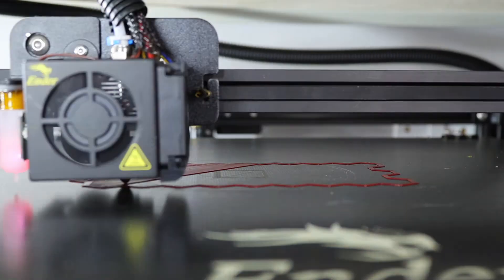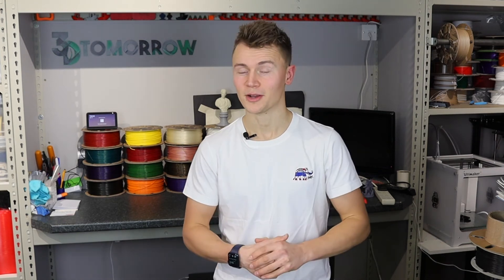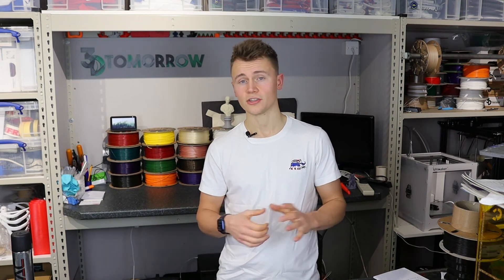So that's the first six steps. At that point you should at minimum have the first few layers going down perfectly with no signs of warping or separation from the build surface. If you haven't, go over them again — I'm pretty confident you will have overlooked something. However, it's still possible to see some separation happening later in the print.